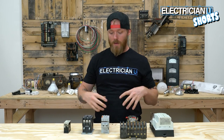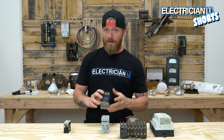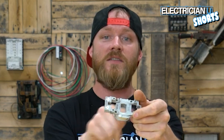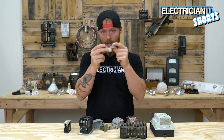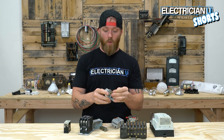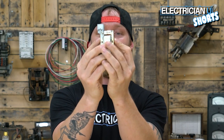So how do they work? First is the coil. The coil inside is just that — from one terminal to the other terminal is a large piece of wire that goes inside. That coil is wrapped around two iron cores, one on the bottom and one on the top.